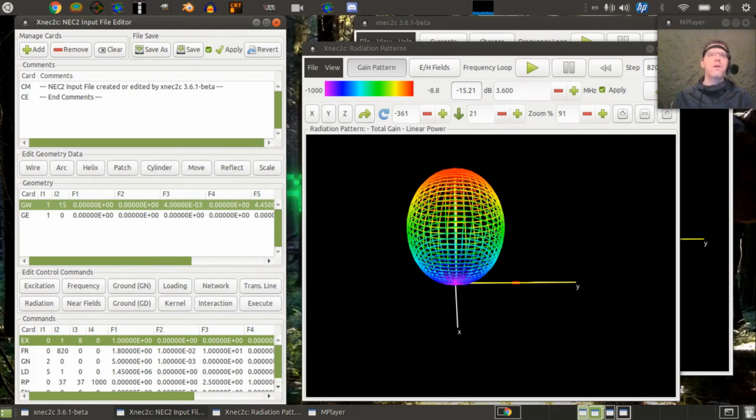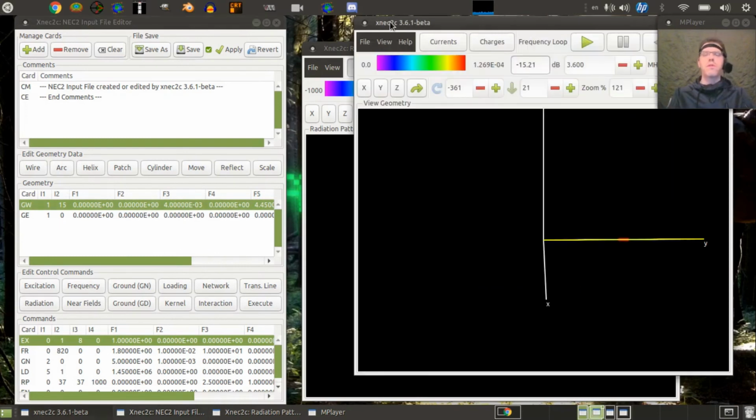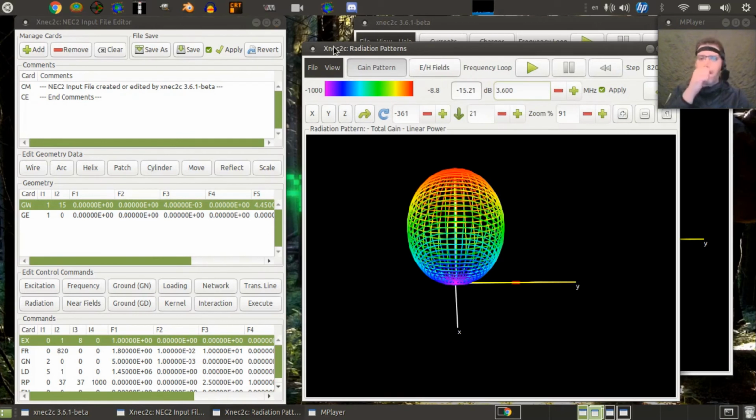non-resonant dipole to be able to use the whole frequency span, we have to have a huge matching ratio also. So there's a lot of problems there, that you may not be able to match everything with a dipole. So that's a consideration also then. So why not use resonant antennas for this reason, or use an antenna that is resonant on each harmonic?